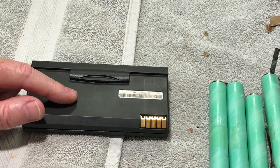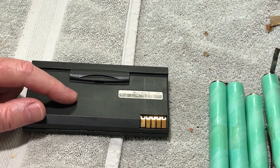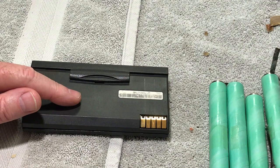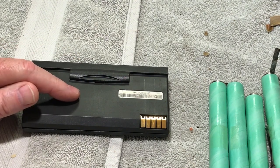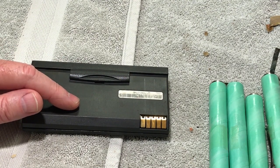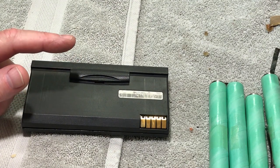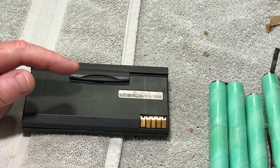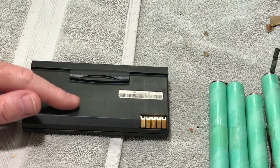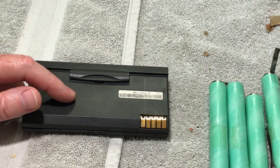As you know, I have a couple of PowerBook 1400 series laptops and the batteries are no good in them, so we've been trying to rebuild this. We did rebuild this battery, but the computer does not see it. I have an actual manual from the day and it tells you different things to do if you're having battery issues. I've reset the power management switch, I've done a PRAM reset, and to no avail — it still does not see this battery even though it has a full charge on it.